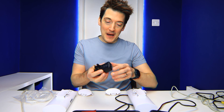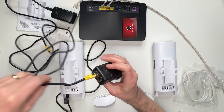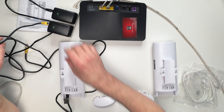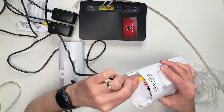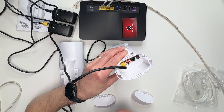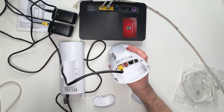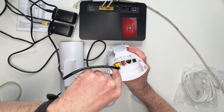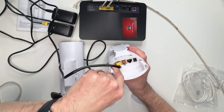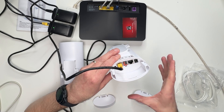Get the second power brick, plug an Ethernet cable into the POE, and connect it to a power supply — the green light shows it is working. Plug in the Ethernet cable to the B transmitter; like before it flashes H for manual configuration mode. Now change the channel number to match the A transmitter — channel five — and after about another minute it should show a solid number five, confirming it is connected.